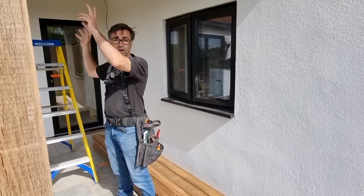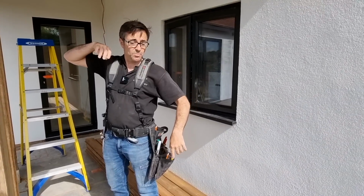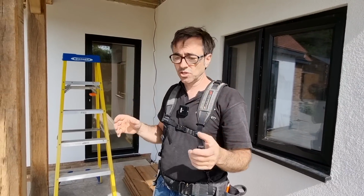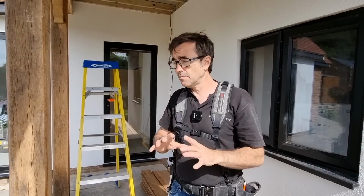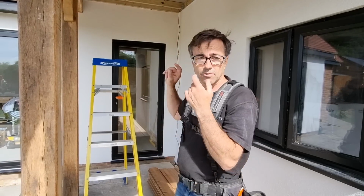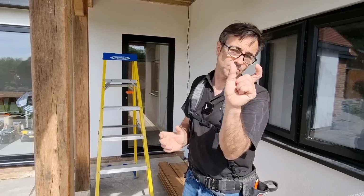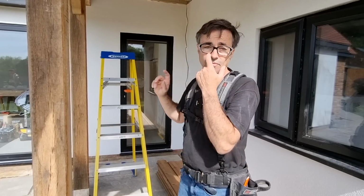So I put a full length up and then with the other piece that I've got ready, measure it, mark it, cut it, fix it. So all I have to do, I will have cut all of my long ones, they'll be ready. And then it's just a matter of cutting the individuals, which are from a pack already cut to size, so I say 50 mil, and then we'll fix those in as well. So I will make a gauge rod for this.